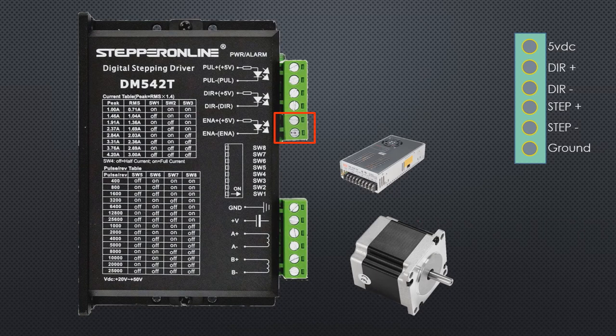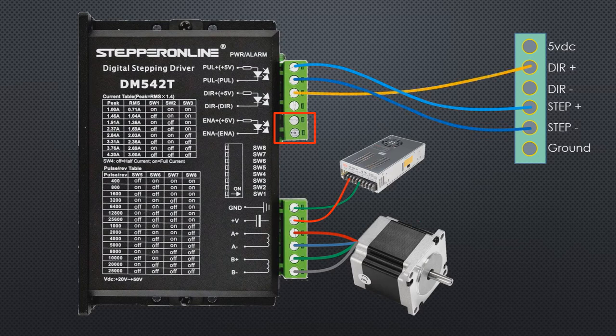We've got a power supply and the stepper we want to drive. Hook the power supply up to give the card all the power it needs, then tie in your stepper motor. This card has a plus and minus pulse — same thing as step and direction. If your driver only has a plus input, you only need to connect the appropriate plus signal. In this case we've got both, so we connect step plus, step minus, direction plus, and direction minus. That's it — the card is set up with all the electrical connections it needs. Then you go into your switch settings to configure current, microstepping, and other settings.